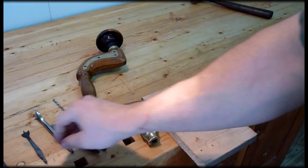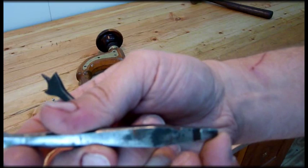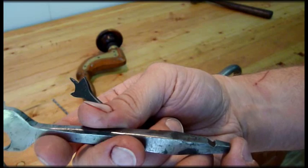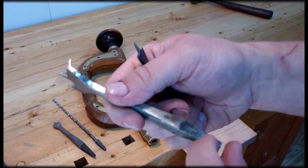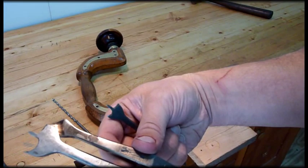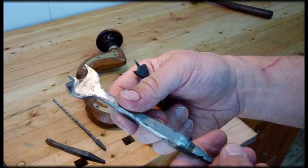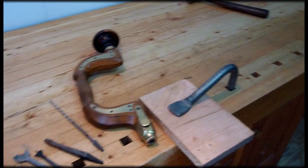These are meant to really work with things like these center bits here. These are beautiful center bits — I love these. And the ones that have the notches in the bottom. This one, for some reason, has two notches in it. There's a notch right there and a notch right there. Whoever owned this bit before probably had a brace like this and found that the notch that came in this bit doesn't work with mine. Typically, the makers would sell bits that went with these tools. The bits had the notch already filed where it needed to be for those tools, and the right taper for them, because the tapers are different in some of these — they're not all the same. This taper is a little different than that one. So typically they would make them individually for each tool. But like I said, you can use them without it — just have to watch out and make sure it doesn't fall out when you take the thing out. Especially with auger bits where it's deep in a hole, grab the bit when you pull it out.